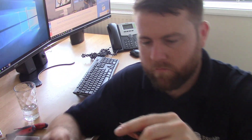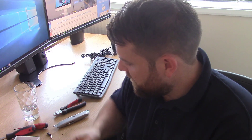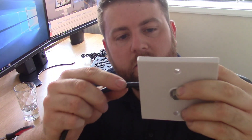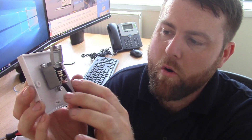Copper-clad steel cable isn't always the end of the world, but if you've got the budget, use the good cable. We're going to prepare it about half a centimetre - a quarter of an inch if you're watching in the USA. Once I've loosened off the inside screw - don't loosen it all the way or it'll fall out and won't go back in - you insert the cable into there. When it's in position, screw it back down and it's safe to work with again.